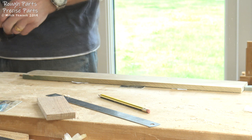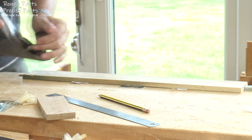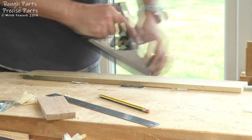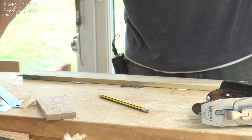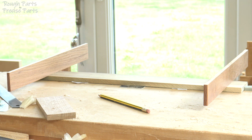Just a few shavings through the middle. You'll reach a point where the plane really doesn't cut much more because the edges of the plane are riding on the wood. Now you'll find it doesn't want to pivot in the middle, which means we can put our winding sticks on so they don't rock — just like I've shown in winding stick videos. And it is very slightly in wind — slightly higher on this side than this side, so high there, high there, low there, and low there.